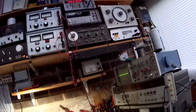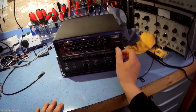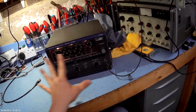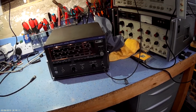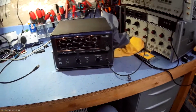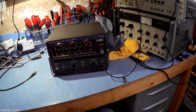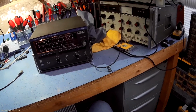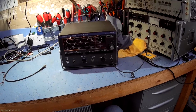Trying to find a service manual for this is actually almost impossible. There's a lot of sites that say they've got the service manual, but when you download it, all it is is the user manual. It'd be nice to get the scale calibration a little bit better than this, so I'll have to investigate that. But it's worth looking out for. They go for £60 to £70. I didn't pay that for this one, because it was in a bit of a beat up state and I didn't know if it was working or not. But a great addition to an FM alignment set. And of course it will do the 455 IF strips for AM as well. So thanks for watching, and more to come.